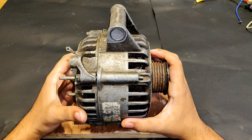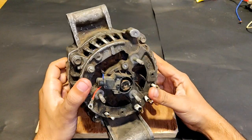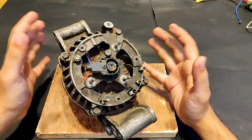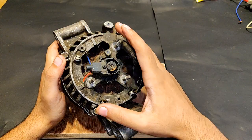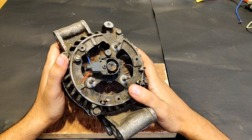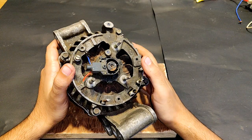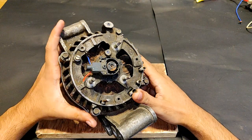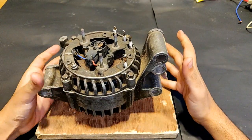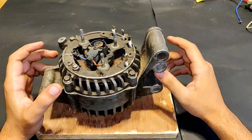What's new about this video is that an alternator is designed to produce 12 volts DC, converted with the help of a three-phase bridge rectifier. What I'm going to do is modify the armature winding and connect all of it in series to increase the voltage at the same RPM. The target is to achieve three times the present voltage — 12 times 3 is 36 volts — although because of the diodes some voltage will be lost in forward biasing.